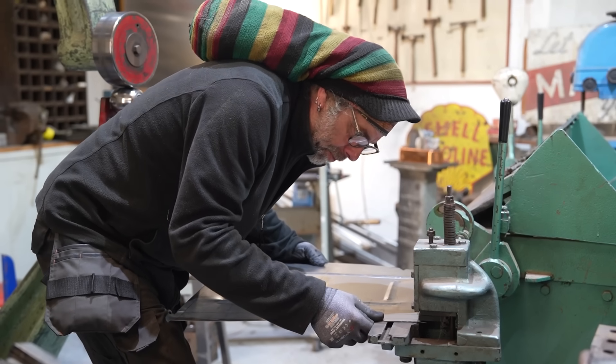We've improved tooling — we've made some new tooling tools around the ends of the beads. The problem was we put too much pre-stretch in the panel, way too much wheeling — I got carried away with the Ranalah. So we've amended that and the new one is coming together. It's looking good. We're going to quickly finish this off and then we can actually get on to the actual day's work of patching in, starting some work on the long side panel, which I'm looking forward to.